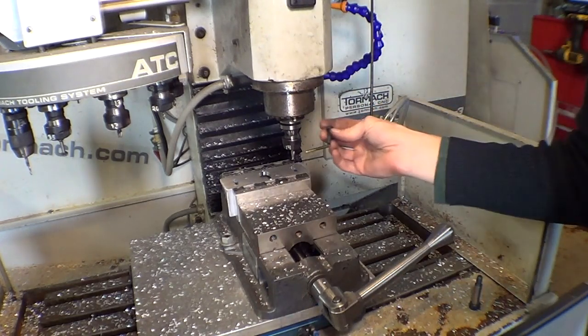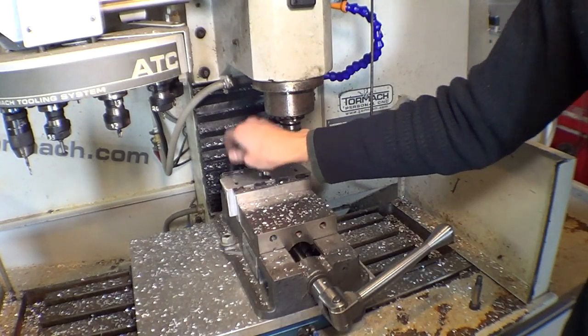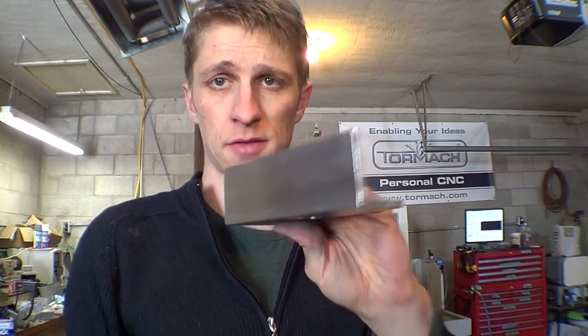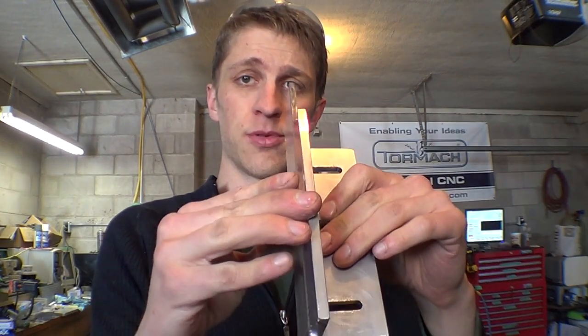And then, like I said before, if you're going to do a test fit: perfect. The bolt goes right through there, and the head of this is what goes through there. Perfect fit. So to make this work, I've got my angle piece here, and since aluminum is a pretty soft metal and the back of the belt is going to be scraping against it, a lot of people use a piece of glass. I believe this is tempered glass. I got it from USA Knife Maker for this purpose. I'm going to use double-sided sticky tape to stick these two together.